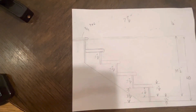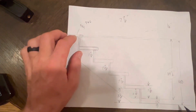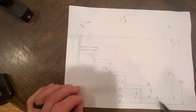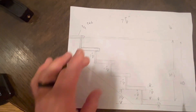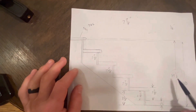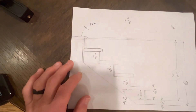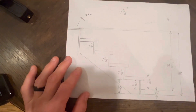None of that is very counterintuitive if you draw it out. If you don't draw it out it's a lot to process. If you've done many of these you can lay it out on the board and do the math as you go, but it's really important that you start with the right number. A lot of people mess this up by taking the subfloor-to-subfloor number, calculating their rises, and then maybe raising the stair up and down to accommodate the floor — but they come up short at the top, or they match it at the top and come up short at the bottom. You'll be off by a half inch one way or the other.